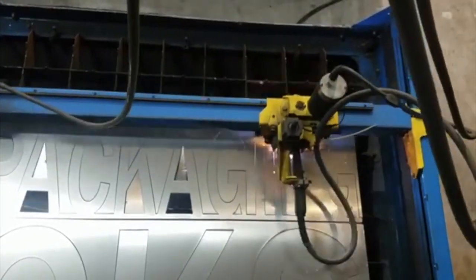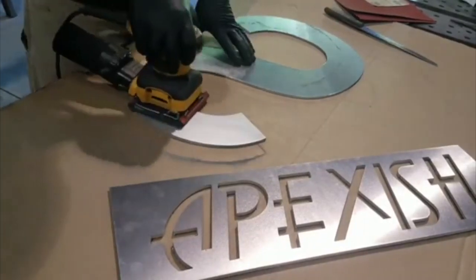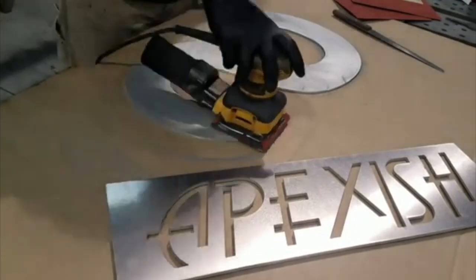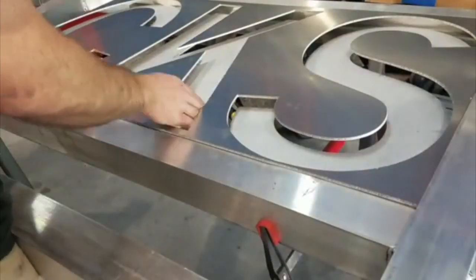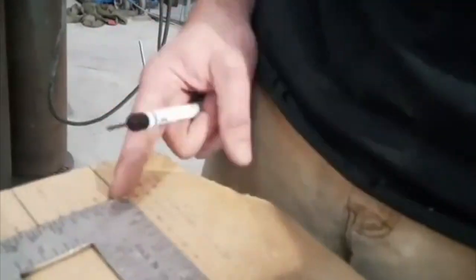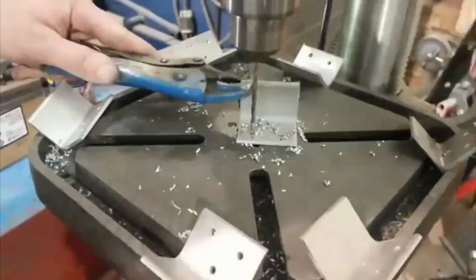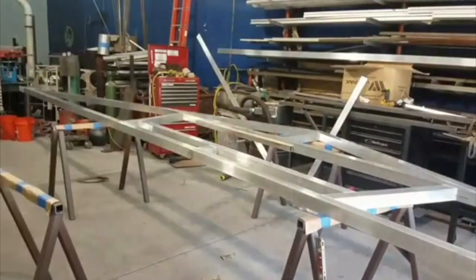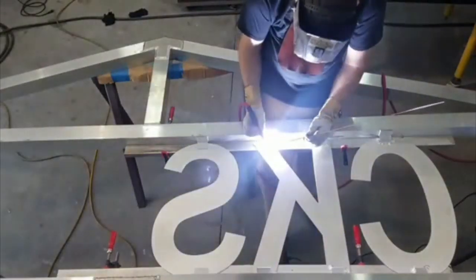Right away, one of the first jobs J.D. got in the new shop was a 60-foot-long rack. He built the whole thing at 60 feet and then cut it apart — so it fits perfectly with no math involved. He just looked and said, okay, this is a good place to cut it. If he'd tried to make three 20-foot sections match up, that would have been a lot more difficult. When you've got the capability to pick up something 60 feet long, building it in one piece and then cutting it and putting flanges on in place means it's going to be straight as an arrow.